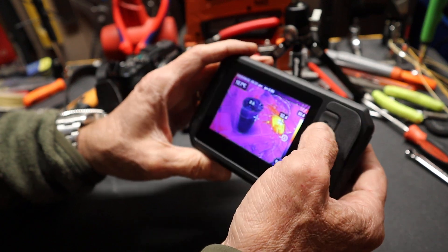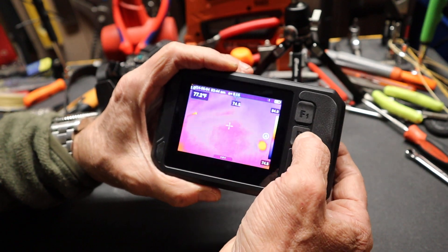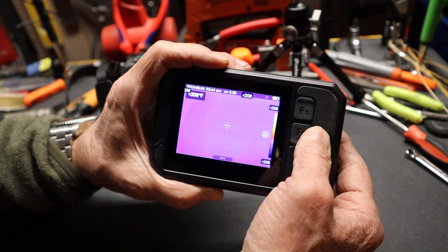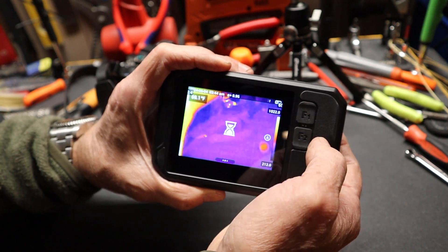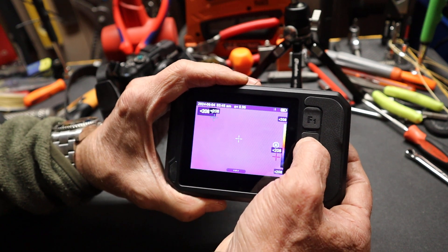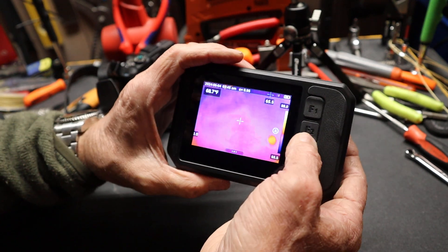If I go to my F2, I can come out of my gallery and go into F2. What it's going to do is switch through the three different temperature modes — different sensitivities. There's an auto one, there's a lower range, and then there's a high range. This is the high — you can see it goes up to a thousand degrees. Everything here stays the same color because the differential between the objects is not enough to fit into that scale. If I drop it down to a lower temperature, now you can see there's stuff going on, including my hand.